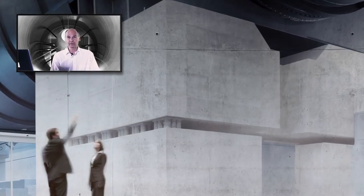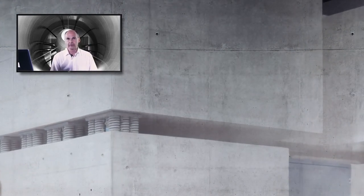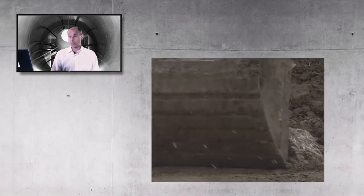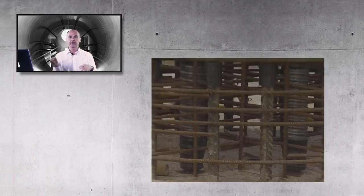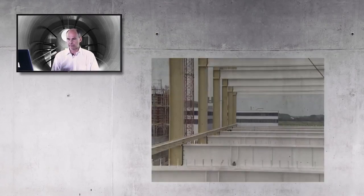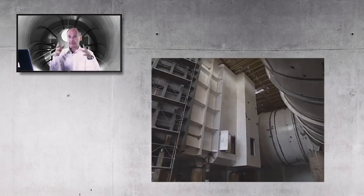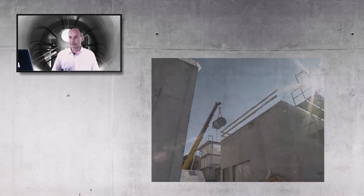So you mount it on a very large mass, and the seismic mass is then mounted on an even bigger mass via, literally, springs and dampers. If you physically go into our wind tunnel and you look at where the fan is mounted, you literally see springs supporting the seismic mass. And then the foundation for the fan is a separate foundation from the rest of the building. It sinks down into the ground a very long way, and there's a soft connection between it and the rest of the building. The vibrations are relatively small, but there are vibrations there that you don't want to go into your building, and in particular you don't want fan vibrations to shake your model, so you have a separate foundation. So just the science of building a wind tunnel in itself is interesting if you're an engineer.